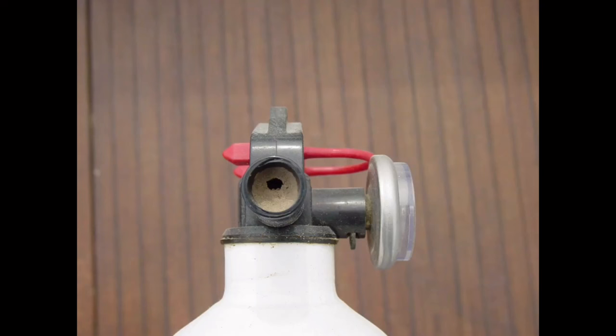Here's a good reason why you should always check your fire extinguishers at least monthly. Mud daubers, spiders, and other critters like to build nests and homes inside the nozzle. This one doesn't look too bad from this angle, but it was actually a couple of chambers thick, and the end was pretty much solidly capped off. This photo is after I dug into it a little bit and was breaking it out before I remembered I should probably take a picture of this.